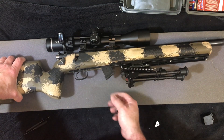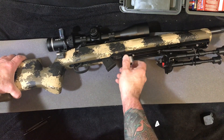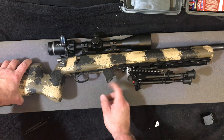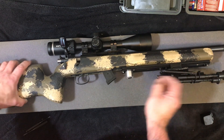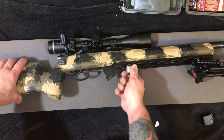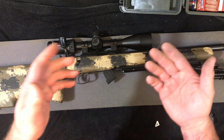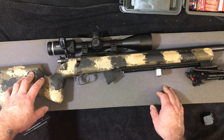So I had to be conscious not to slam my bipod all the way back. I made this guy out of a piece of aluminum scrap. It's a piece of aluminum cut out with a hole saw, and it's got a quarter-inch by 20, which matches the camera adapter quarter-by-20 on an arca rail. I put a piece of ABS to protect the arca rail with a nut threaded through. I heat blued the end just for aesthetics. It threads into the bosses on this rail and serves as a barricade stop, a sling arm cuff mount, and stops the bipod from traveling too far back. I can also remove it and screw it into any of the locations on the rail — there are multiple positions I can use it as a hand stop.